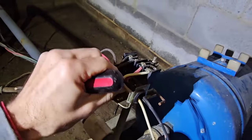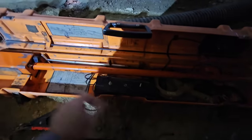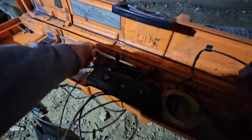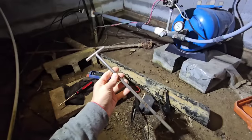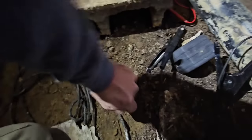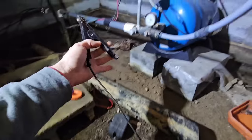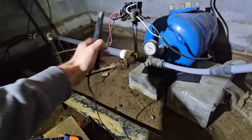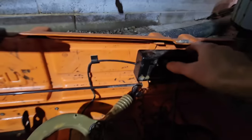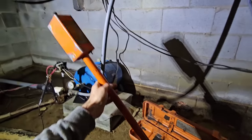We're just going to take it out from underneath the switch and leave it pulling out like so. I'm going to take our underground cable locator and connect it to that wire to send the signal through it. This here is my grounding — I'm going to push this deep into the ground. Take one of our clamps, clamp it on the ground wire. This is going to be our signal. We know it doesn't have power. We're going to clamp on that wire and when I flip this switch it'll send that pulsating signal through it — then go find it.